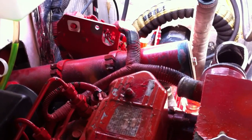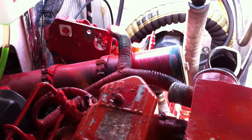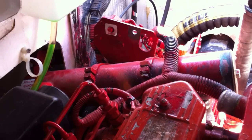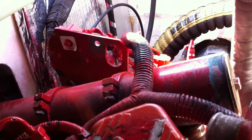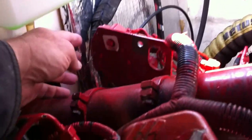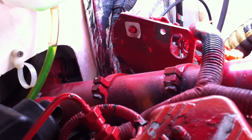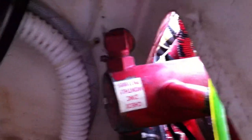We're taking the heat exchanger out of the engine so we can get it cleaned up and tested. To do that, we had to get the hoses off - cut all the hoses off the heat exchanger, I'm going to put new ones on. It's easier to cut them than pull them off while it's in there. To get the heat exchanger off, you've got to loosen the bracket up here in the back that holds all the electronics, and loosen up the wires in the back so they're free - a couple of tie wraps you've got to cut. Then remove all the hoses, twist it around a little bit, and slide it out right into the locker over here. There it is, half in the locker.